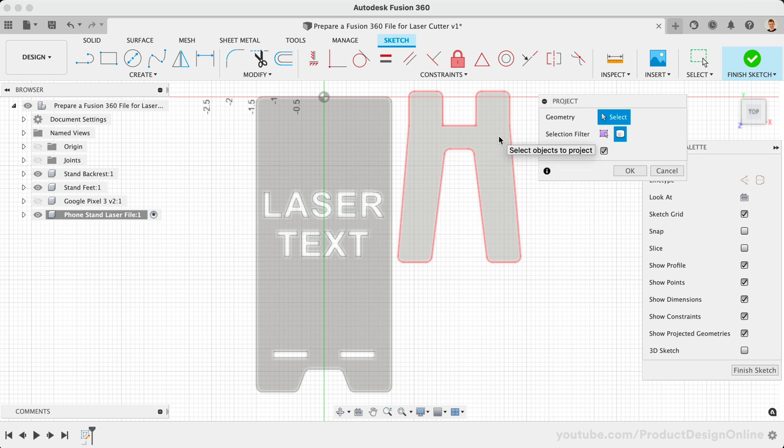That's what we want, as we need the laser to follow the outer contour of the shape. If I switch to the Specified Entities option, you'll see that individual edges or points appear on hover. We could technically select all of the individual edges around the object to achieve the same result. However, doing so means we risk missing an entity. Any small segments missing from your contour will not be followed by the laser cutter. When possible, start with the Body Selector, which will help ensure you include the entire contour.